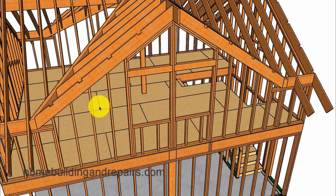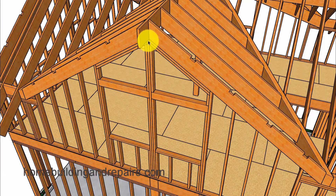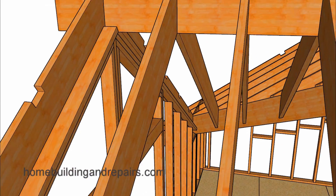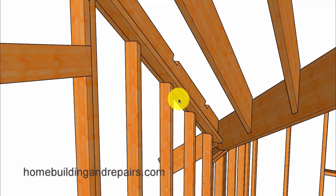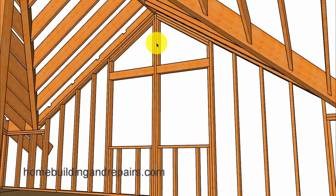Next let's go ahead and install our wall here. We're going to have two windows along with two shaped rake windows up here. This is a common detail used by architects for gable roofs or dormers. You can see where we have a two-by-four running from the bottom of the ridge all the way down to the framing plate to provide additional structural support for the ridge. And of course we have our ceiling backing, or drywall backing for the ceiling. Another thing you can do is add some support studs underneath the hip, or a post — whatever you or your engineer feel will work the best.